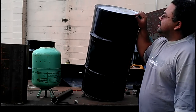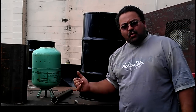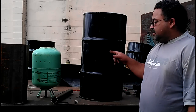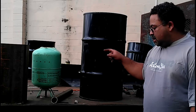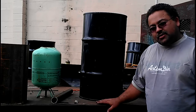I'll just go ahead and start cutting it into this. I've seen others have problems with doors. I still want a large door — I don't want to use a small pipe like I've seen on some of the other videos. I want something easy access. So what I've decided is I'm going to use some angle iron and make a square door and weld that all on there. That way I could just use a flat plate, and that should be a lot easier to seal than trying to seal around a round surface.